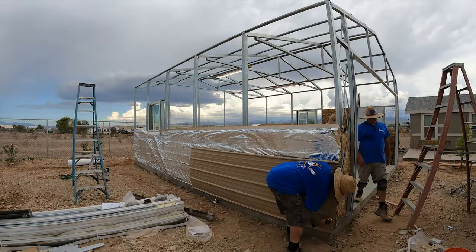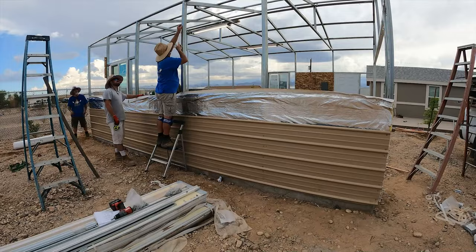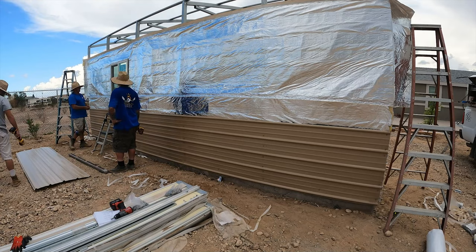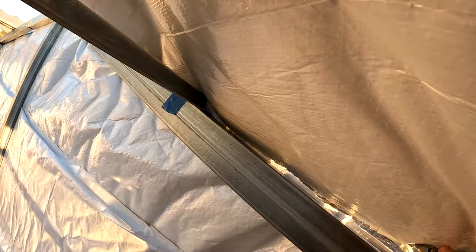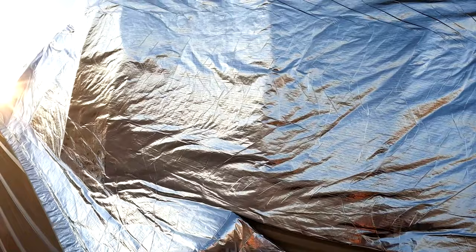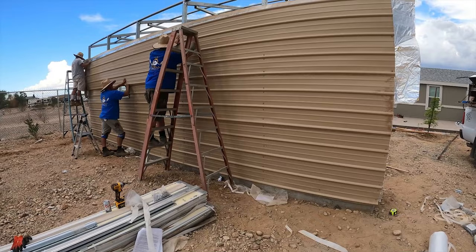That OSB gives me my workbench area and the electrical that I can fasten to — you'll see at the end how we arranged it; it turned out really nice. Here's the insulation going up. This insulation comes with the kit and it has a self-adhesive — you pull that tape off and you have adhesive built into every chunk you roll out, so it sticks right to the metal and sticks to itself on every seam. We're only laying about a four foot piece at a time because if it's windy and you try to lay more, it'll all blow down on you. So we lay one chunk, then put the metal up.